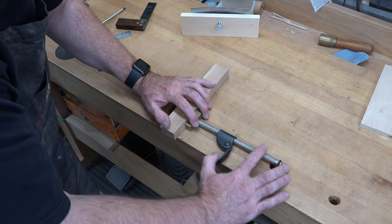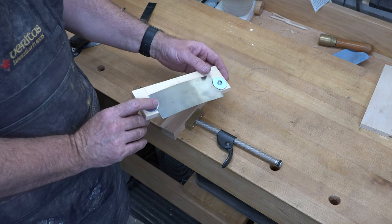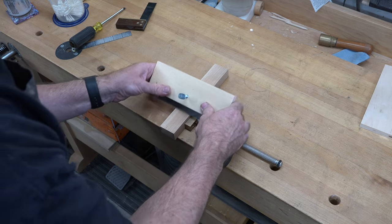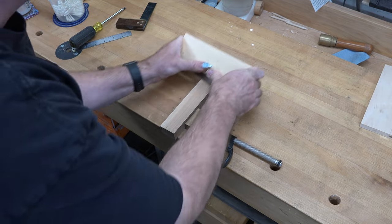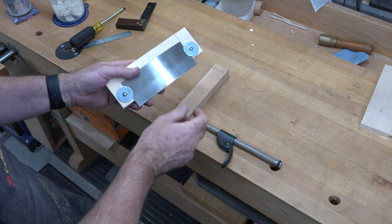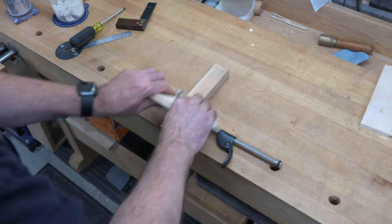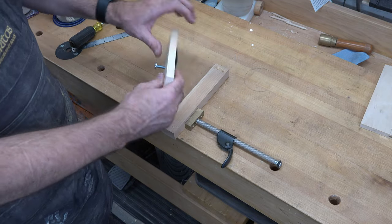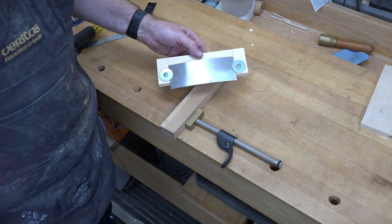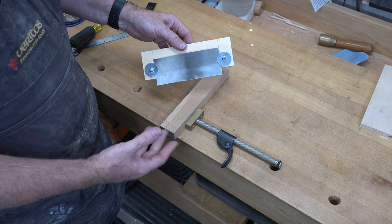Place your workpiece on the bench and this simple jig bows the card scraper and does the job that is so tiring on the hands — keeping it in that bent position. You've essentially made yourself an economy card scraper holder. There's very little hand fatigue because you don't have to constantly bend it yourself. You can even use it in reverse. It's a lot less fatiguing and goes a long way to saving your hands in the shop.